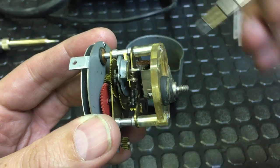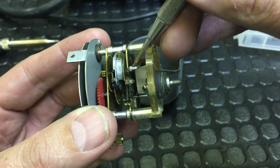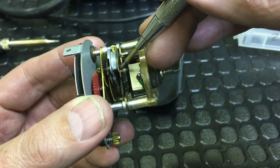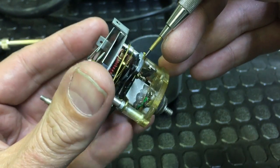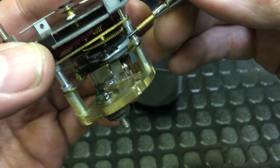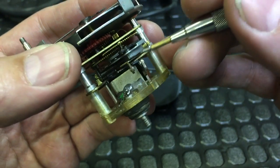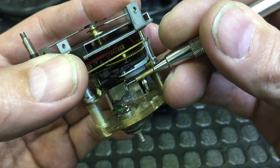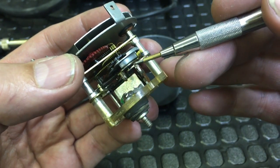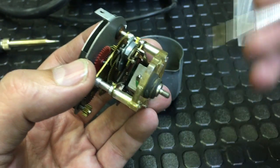This happens very fast — it slams it down. There's a little bit of inertia in this assembly that carries the winder past the point where the contactor stops, which then breaks the circuit so the solenoid does not remain energized. Now the winder works its way back up. There is a ratchet here, and when the winder is moved, that's locking it into this gear, which is connected to other gears and so on. The energy in the spring, as I mentioned, pulls it back around, and when it makes contact, we start the whole process over again.